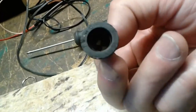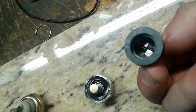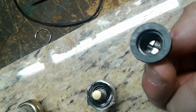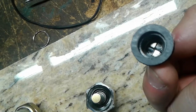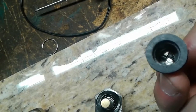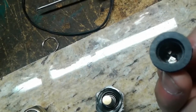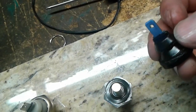There are the contacts inside — two contacts right there. There's supposed to be air able to be squeezed out through there, otherwise your switch is just going to become hydro-locked and it's not going to do anything. So it is normal for it to leak like that when it fails. Just adding crazy glue to the end is not going to work.